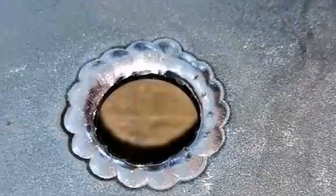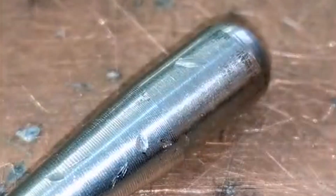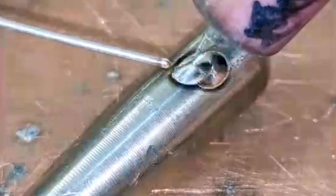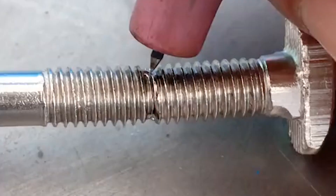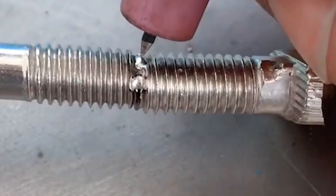This is a cold welding machine with welding wire to repair the scratches and wear and tear of accessories. The solder joints are white. The depressions, holes, and pits in the plane of many accessories can be filled, because of the low current and stable operation of the cold welder.